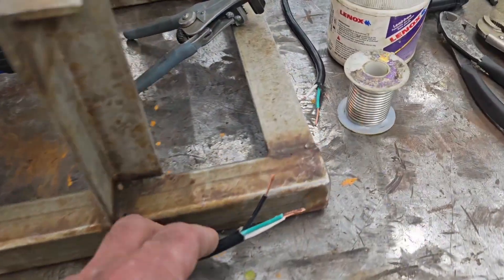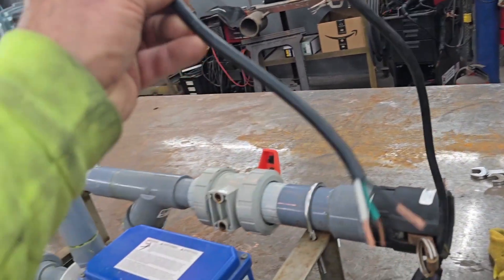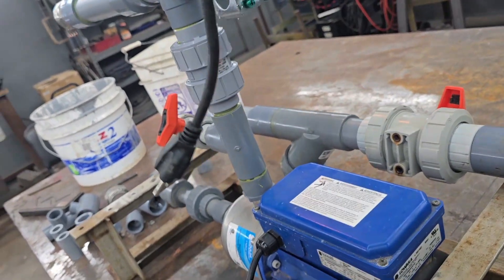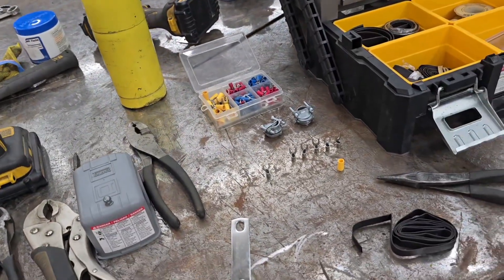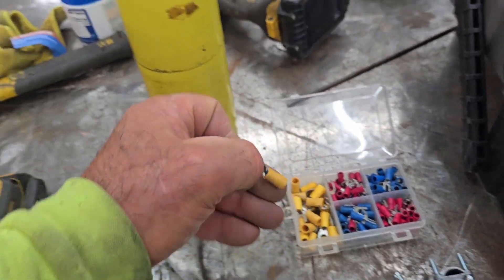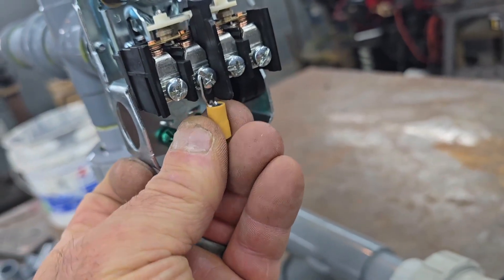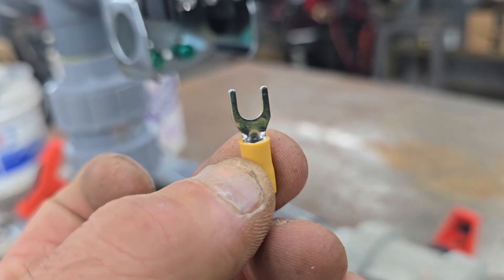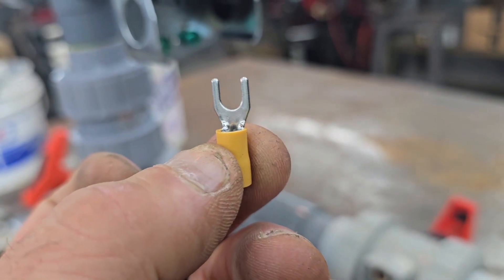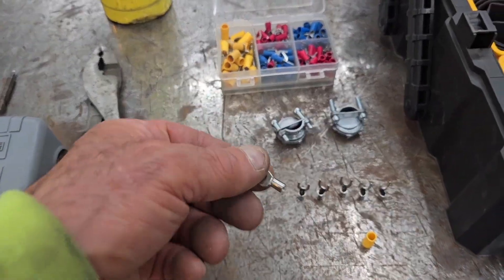On the wiring, I can show you I've got the wires to the pump that need to go to the pressure switch, and the wire I've cut off is just a 120-volt that you would plug in. What you run into on these pumps is a lot of times you need a fitting like this to go onto your pressure switch. Traditionally the way these are done is you put the wire through and smash it — I've had those come apart or make a bad connection a lot. I'm not crazy about that setup, and you'll see what I've done here.